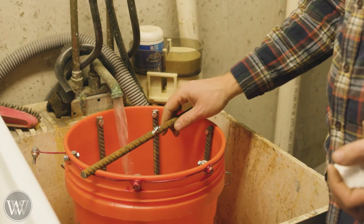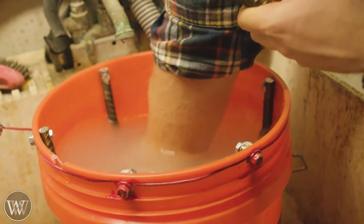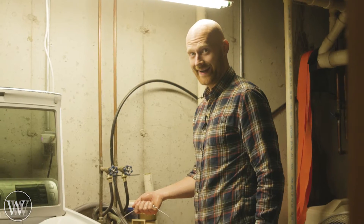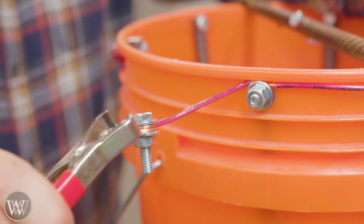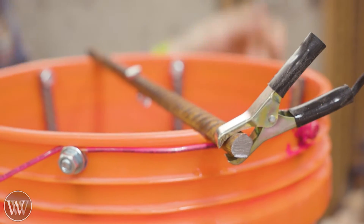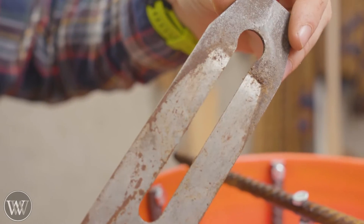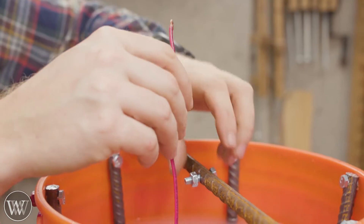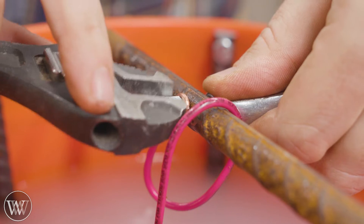You could just put a wire on there and hang something on it like I did. Next, we're going to fill it full of water and then I'm adding about a half cup of washing soda — make sure you search for washing soda, I'll link it in the description. This is what allows the electricity to easily flow through the liquid to get to the anode on the outside. Connect the black wire to the piece you are working on and the red wire to the outside. Then whatever you want to clean, hang it from that middle bar and let it hang in the water. If there's a bunch of loose items, that's where the little aluminum basket comes in. Wrap it around a bolt in the middle of the wire and this will allow you to pass electricity from the negative to the positive.